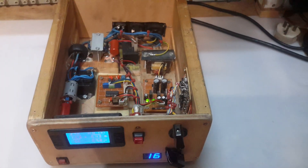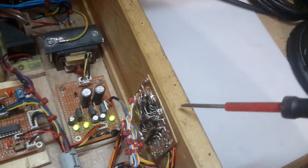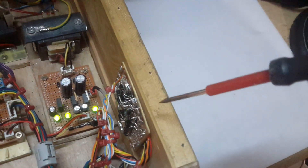The way I did this LED meter at the front is an old fashioned technique called diode steering. It's not pretty, but it gets the job done and it avoids needing a microcontroller.